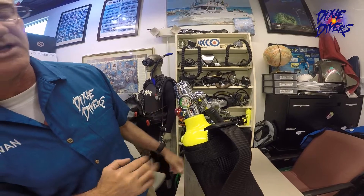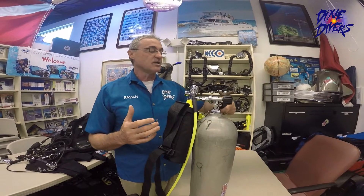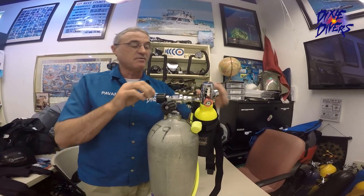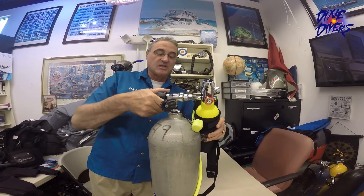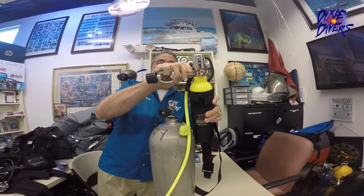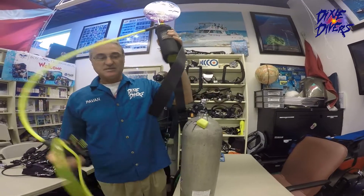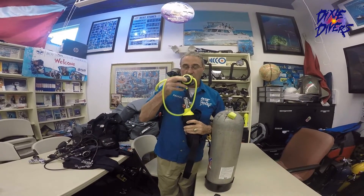You can see the numbers right there — it's overpassing 2,000 PSI and going toward 3,000 PSI, almost 3,000 PSI. Now we've equalized and the tank is full. What you do is close the tank right here, close it back. Then you purge it — you just turn and twist it. It has a one-way valve so it's not going to leak. Then you disconnect it here with the quick disconnect, and you put the protector back on.